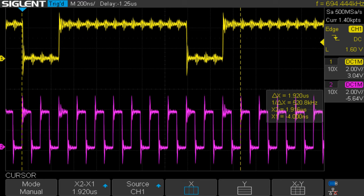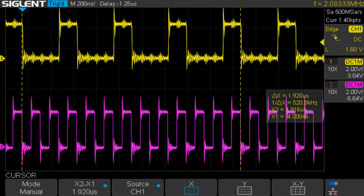If I move the probe now, the top one, the yellow trace, which you remember is also the trigger trace, that is now moved over to the right output signal. And you can see now more closely that 3.5 cycles equals 1 whole instruction period. But you can also see that we're on the falling edge of the phi clock when the memory request signal goes low and becomes active, okay?